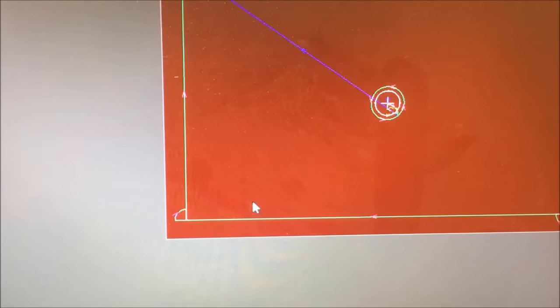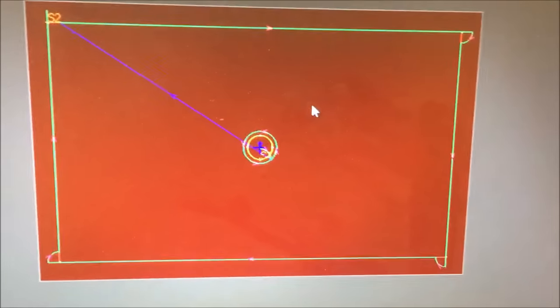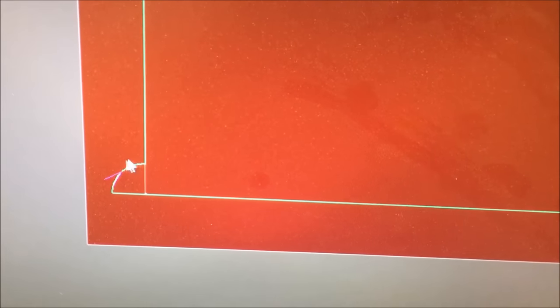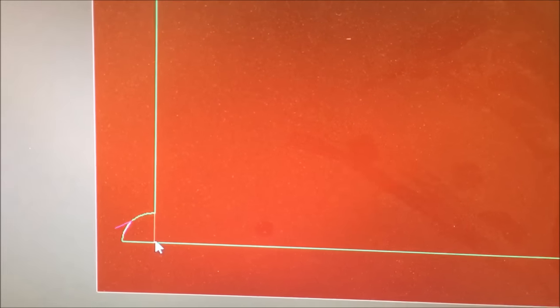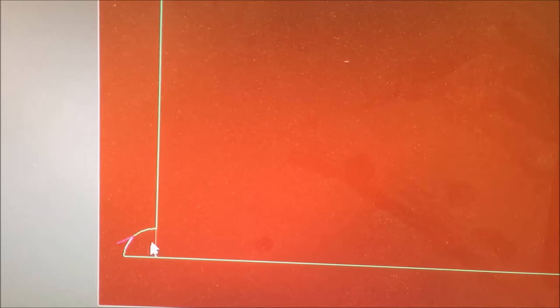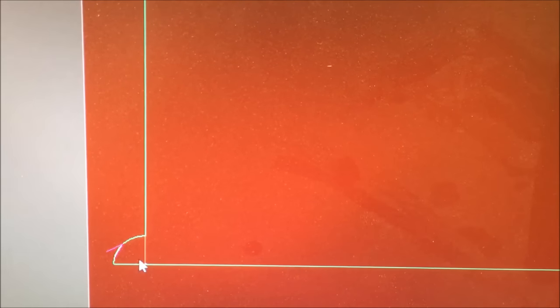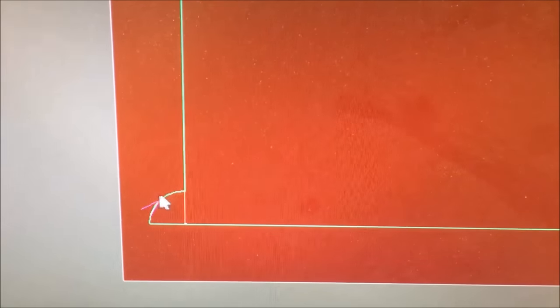A little better explanation about how the sharp corners are cut with the drag knife. As you can see here, this arc right here is actually indicating where the drag knife has to be lifted up, slightly enough for it to be able to still turn inside the material — like maybe five thou or something. The software turns the blade, then puts it down in the material and keeps cutting. That's what the symbol here means.